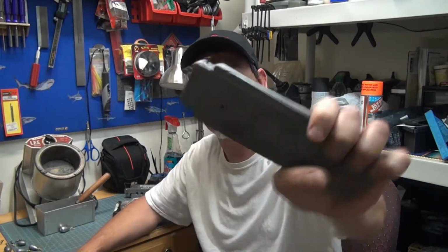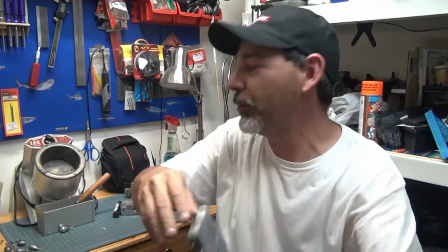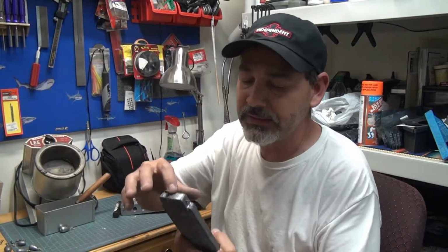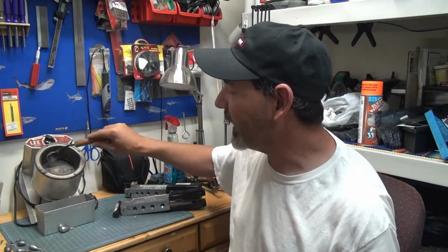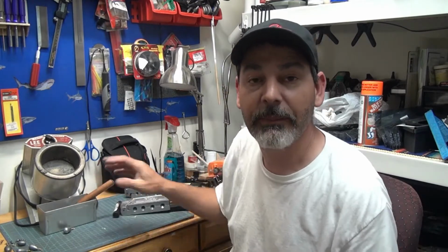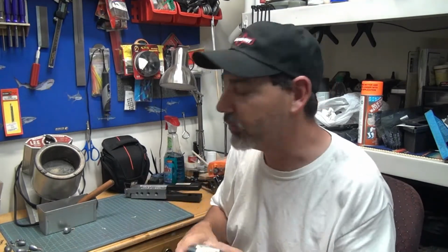and see what kind of lead they have. Ask them, do you guys have lead that I can buy, just raw lead or whatever. I usually find things like this that are just raw lead. It does have some pieces of brass or some things like that, but when you put it in the smelter, it'll melt all this stuff away. Anything that's impure, you just clean all that slag up. And I usually use this little metal box here to scoop it up and clean it all up. And it's pretty simple. You can't go wrong with that, if you have the molds.